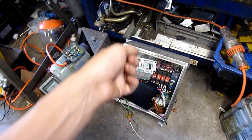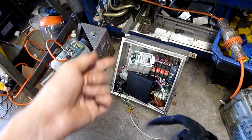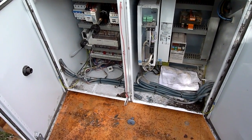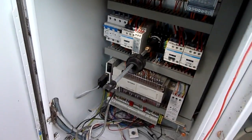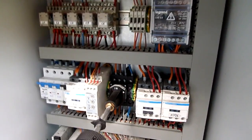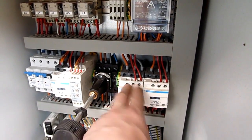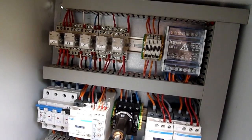Be careful what you buy. If it's completely unopened and they won't let you open it, you may be getting something that's already been stripped out, or something that's had its own little weather system going on inside for several years and is completely ruined. Preferably carry a combination key in your pocket — it's a three-ended plastic molded key that suits all the common styles of cabinet lock — Rittal, ABB, all those different types.